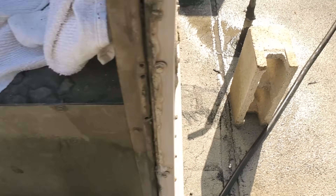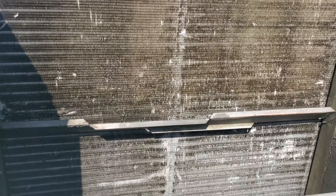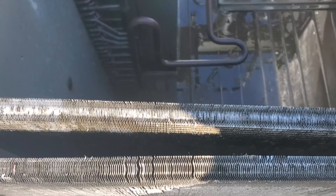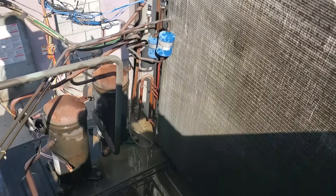This guy is about as clean as we can get it without going too crazy. The drain pan's nice and clear. Coils, you know, it's not perfect on the other side, but I'm not going to try to make it perfectly shiny. We've still got a little bit of vacuuming on the side. Went ahead and got on the condenser coil. Now this coil's pretty damaged on the outside. We split it here because we've got the top off, we can get down inside. It's not too bad. Put a little bit of cleaner on it, got all the way around.